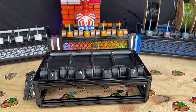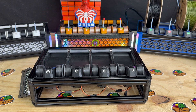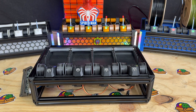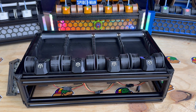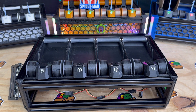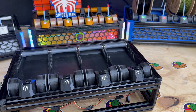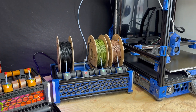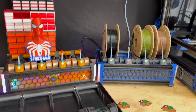We'll do a full video later specifically on Box Turtle. Right now I just wanted to go over some of the design choices, how it operates, and what makes it different from other available filament changers. Box Turtle is a modular filament changer so you can build and configure it to be as many lanes as you want — you'll notice that one's three, someone's built one with six, there's a couple with five. Using the AFC Clipper add-on, this printer has two of them hooked up to it.